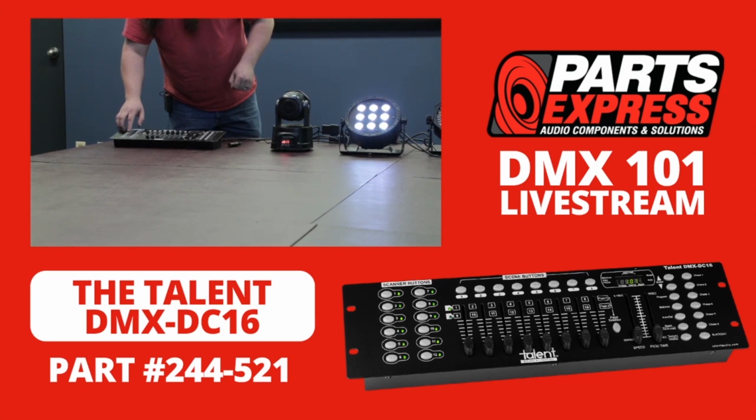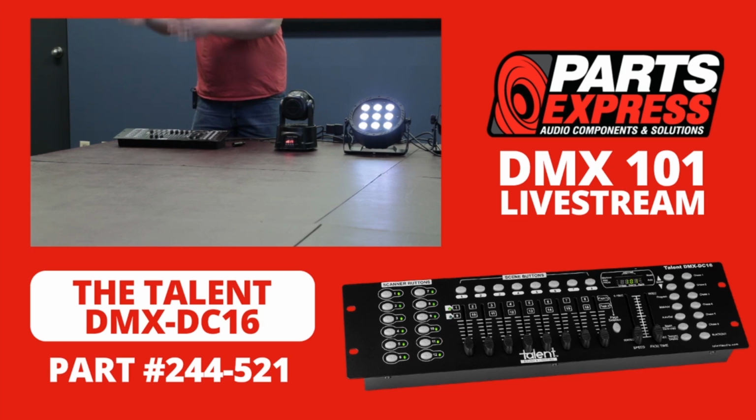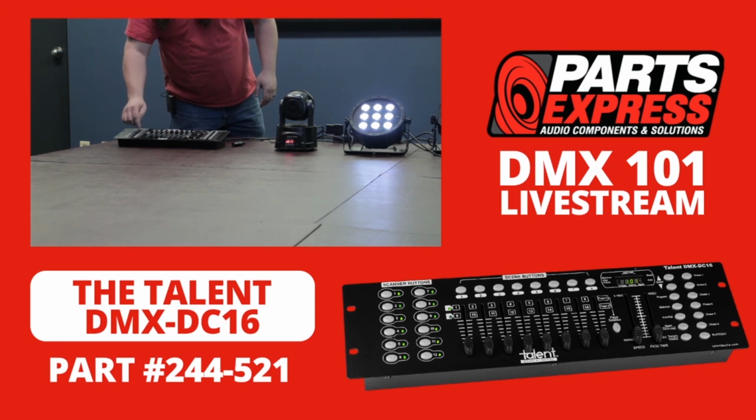Now the second one starts at 17, because each one of these takes up 16 channels. So the first one will start at 1, the second one will start at 17, next one will start at 33. You basically just keep adding 16 to each one of these to get where you want it to start.